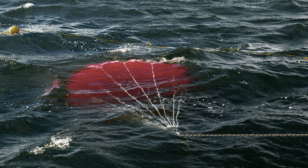We decided to deploy the para-anchor. I had read enough that I figured once it was deployed, we'd be pretty stable and be able to get some good sleep, and the boat would be safe. We were getting up to 18 knots going down the waves, surfing with a double-reef main up. That's when I probably should have headed into the wind and dropped the main altogether. What was happening is we were losing our autopilot, so I was having to steer all the time. The waves were big enough — we were concerned about broaching — so we decided to deploy the para-anchor.